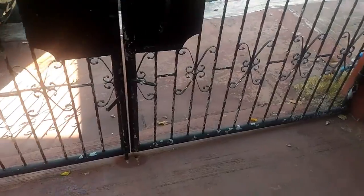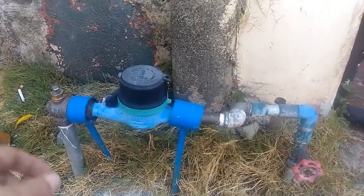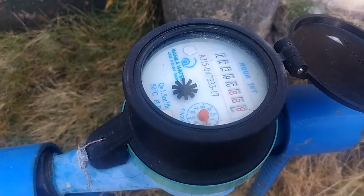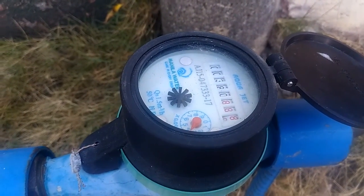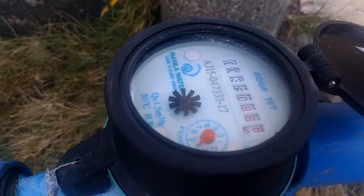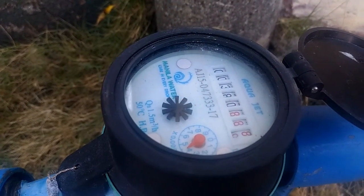What's up YouTube, handyman007 here. Today I'm going to show you how to tell if there's a water leak within your house. The easiest way to identify that is by looking at your main water meter and seeing if the gauge is turning or not. If you know for a fact that all of the water inside the house is turned off and it's still moving, you can verify that there is indeed a leak somewhere.